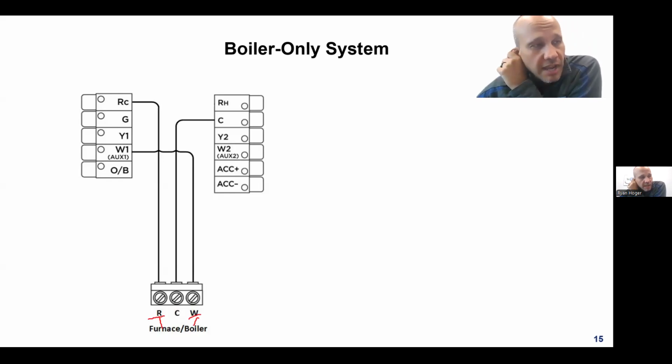But most thermostats, if you're going to get a cool thermostat, meaning a display, a Wi-Fi chip, a microprocessor, anything like that, you need a common wire as well, like I stated previously. So you will need 3 wires down to that boiler. You won't have that. You'll only have 2 because no one ever thought that there would ever be a reason for a third wire back in 1945. So you will only have 2 wires, and you'll need to pull a third wire in order to get the cool thermostat to power. Cool meaning whatever your favorite brand of stat is.